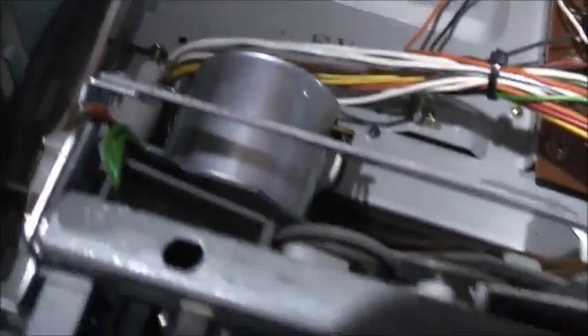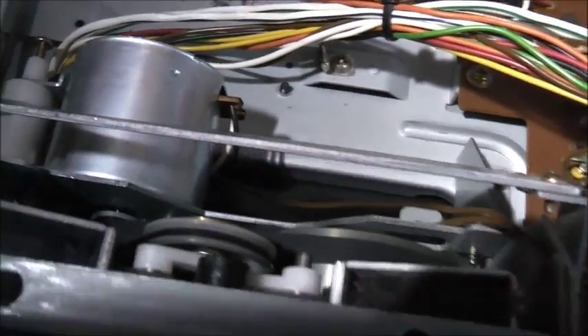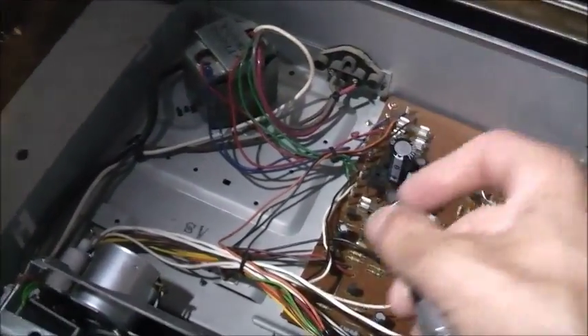I fixed it, and then the motor just revs — it's on the rev limiter. Have a listen to that. It's got a big cam in the motor and it's fluctuating. It doesn't matter what the setting on the potentiometer — it does it the same, unless I turn the motor to full speed, then it's fine. I've measured the power supply to the motor and it's fluctuating between 12 and 14 volts. There's something wrong with the board.